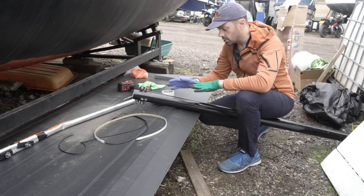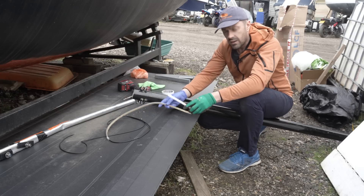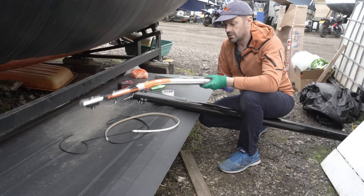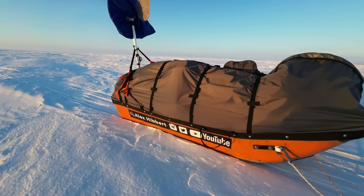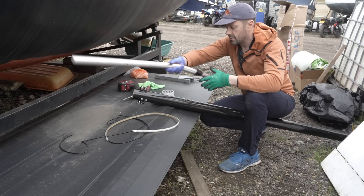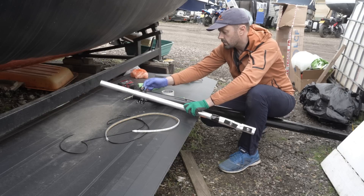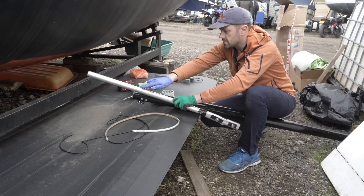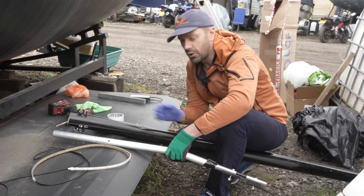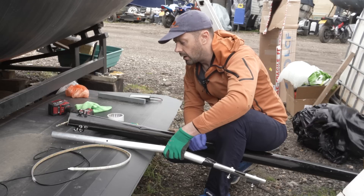Now that I've got these two eyes out, there are two main jobs to install up this end of the mast. The first is a wrap-around fully-sealed IP68 LED light — that's going to be my main 360-degree light — and that cable will run down the middle of the mast. Secondly, a bit more complicated: this is a mount I was using on the back of my sledge in the Arctic, and it's to mount a wind generator onto. I'm going to mutilate this a bit, chopping off here — I don't need this bent section — and then mount it inside the mast using the same bolt holes as before. That should give me the correct amount of this thinner pole sticking up the top to allow the wind generator to fully rotate. These are the final few bits that need to go on before I get the horizontal on for the two antennas — not aerials, antennas — and then the whole mast can be assembled and put up top.